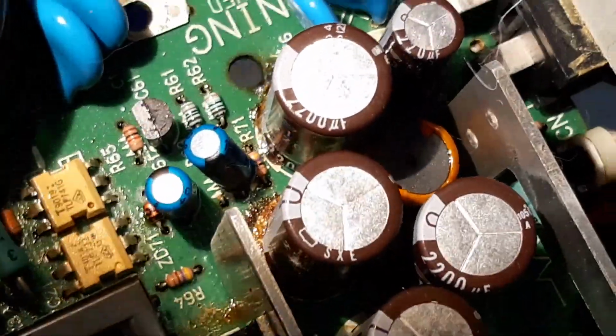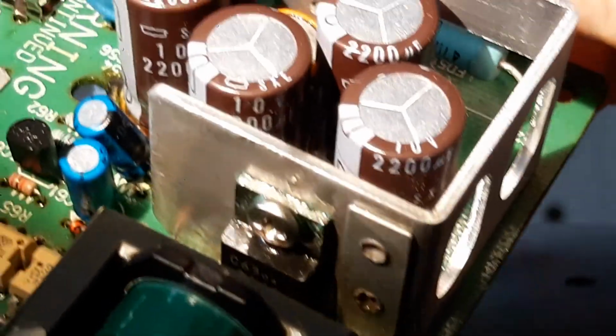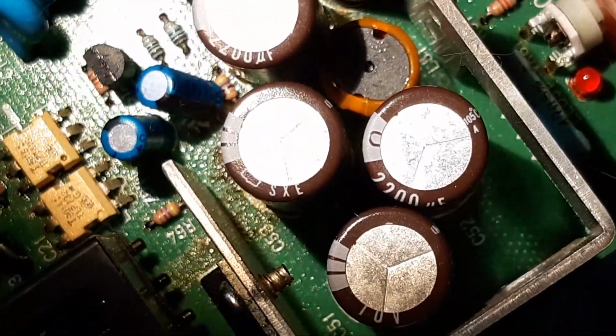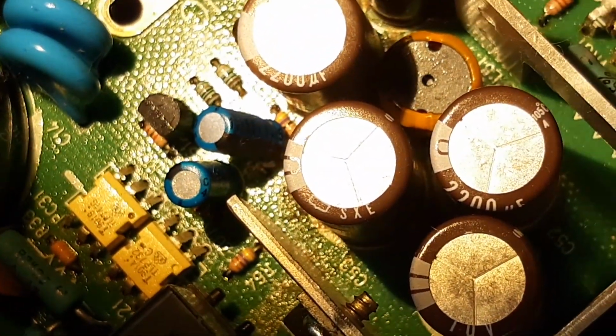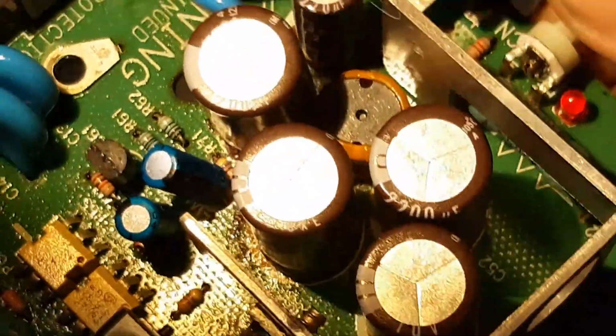So you're going to be needing to order 4 10-volt 2200 mic capacitors. Watch your diameter on them again. I will probably pause this and tell you what these are. These look to be about 12 mil diameter. I'll get my vernier out in a bit and we'll check on that one. Hey, the video's gone yellow.